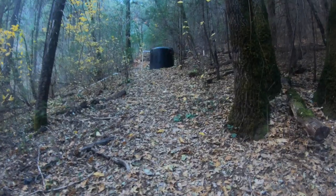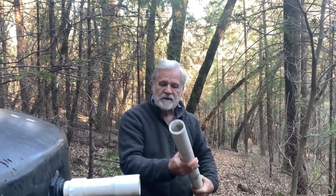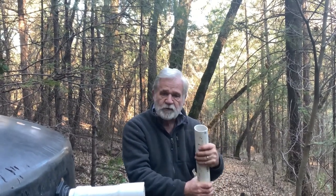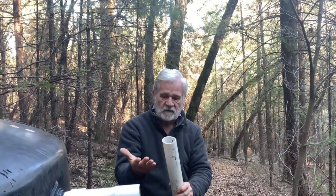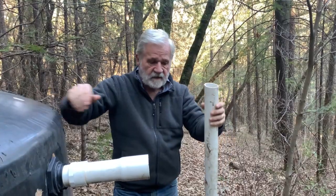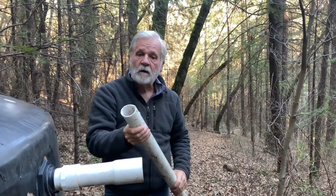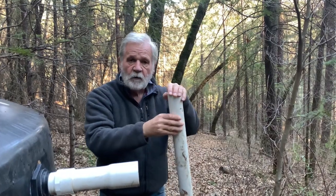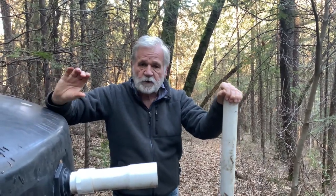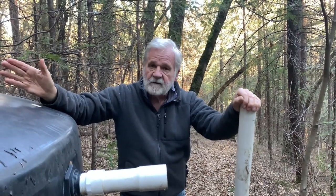Two more things to cover but we're going to have to take a walk up the hill so I can show you. One of the limitations of our system is this two-inch PVC pipe which was already in place to deliver water to the house. When we multitasked it to also deliver water to our turbine there were two results: one is we can't expand the system — if we want more energy we'd have to replace this pipe because it's running at about capacity. The second thing is that when we're delivering water to the house and running the turbine at the same time, water pressure to the house is reduced. We were originally worried about this because we have demand water heaters that require a certain level of water pressure to be activated. Turns out we can run the system and get plenty of water for our showers and the propane water heater still works.